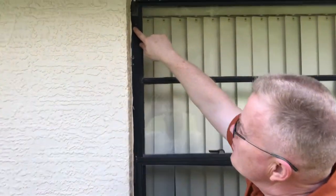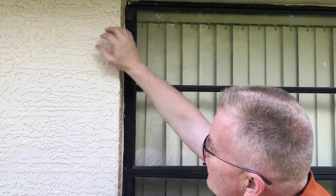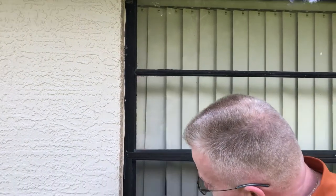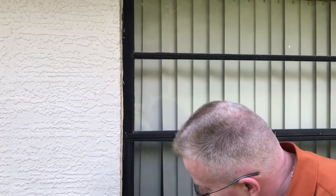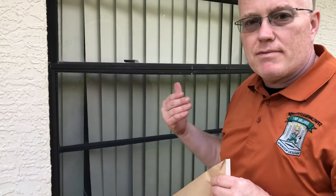The worst of it is right here — that's 3/16 of an inch of block paint onto the window. Just take a look up and down. Here it's a quarter of an inch, so what you want to do is make your paint line a quarter of an inch onto the window.